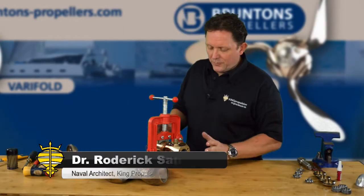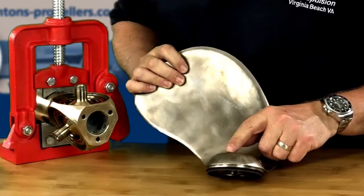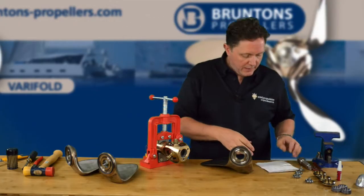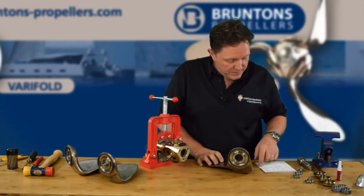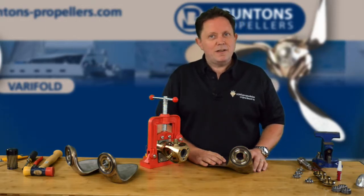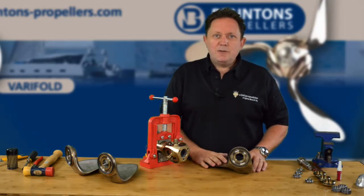So we're now in the home stretch. We've got the hub and all the races in. The last thing to do is take your blades. If you can see this on the camera, this one is actually numbered — AP7355RH, right hand, and it has a number one on it as well. So it tells you what the blade numbers were. When we took it apart, I've got my little cheat sheet here — I wrote down what the blade numbers were, and I actually did a center pop on the hub. There wasn't normally a mark there, so I can correlate and know that this position and this blade went together. This is important because when they're assembled they're dynamically balanced in the factory, and you can't actually get this done anywhere in the world. It needs a special jig, so if it does have a vibration or anything that needs fixing, it does unfortunately have to go back to the factory. So it's always a good idea to keep track of these things.